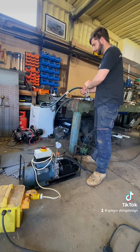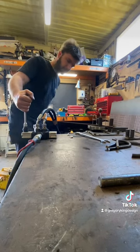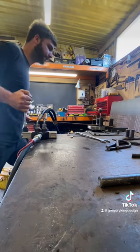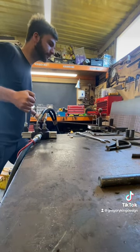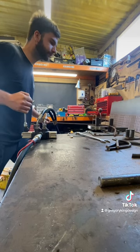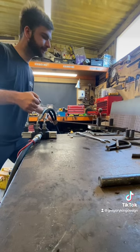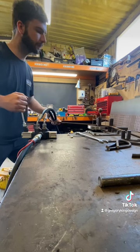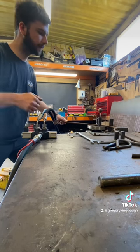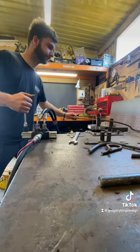There's the pump off the hydraulic press and a new spool valve — bleeding all the air out of it — and there we go, it's turning! It does turn a little bit quickly, so I might put a restrictor or flow control valve in so I can adjust the full speed. It's not quite as powerful as I'd hoped, but it is incredibly powerful. Its limit seems to be 14mm OD bar, which is plenty.